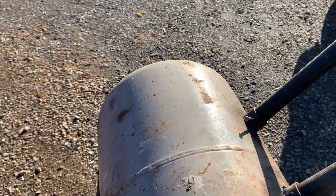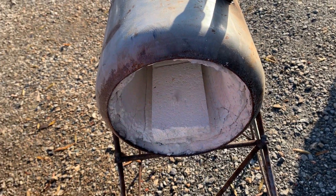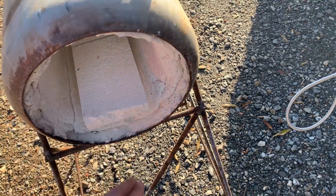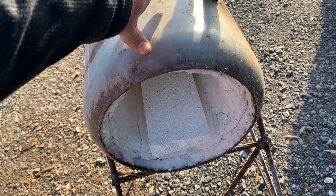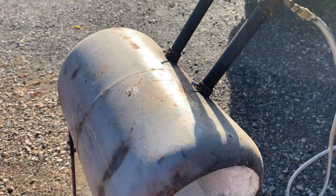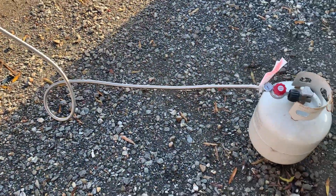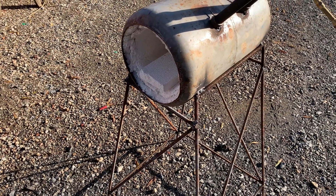This is the forge that I just built and it's a little rough. The liner — I found it somewhere really cheap — is about an inch and a half to two inches thick, and then there are some ceramic fire bricks. I've tried it one other time and it did really good. It's got two burners — forced air type — hooked up to a small propane tank. I've got everything set up; I just have to cook dinner and then we'll get started.